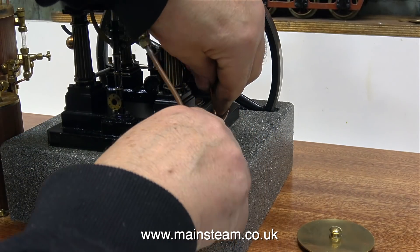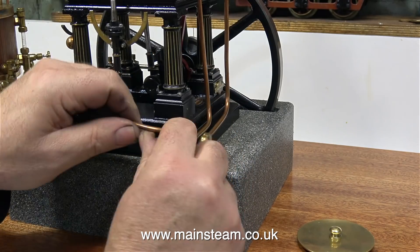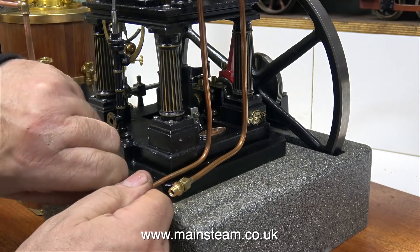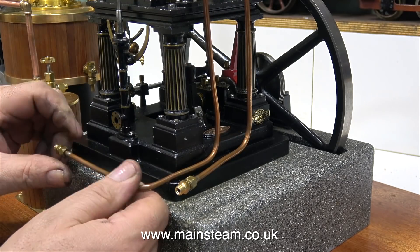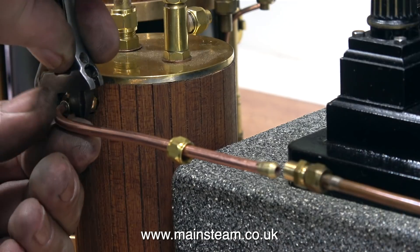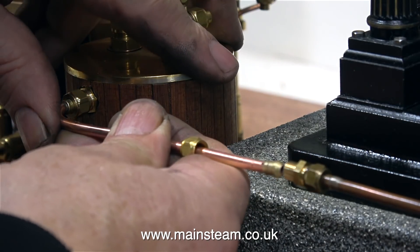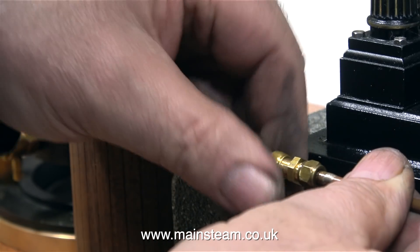I'm going to see whether it's possible to use the existing piping. It's pointing in the wrong direction, so I'm bending it in the opposite direction, which is generally not a good thing to do. Copper work hardens very easily, so after a couple of bends it stops bending — but this copper is bending very well indeed. Having the vice-like grip of a keyboard player comes in quite handy, and in no time at all the pipe is bent to where I need it to be. I've made up an extension piece that goes from the condenser to a quarter by 40 union on the existing pipe, and when all this is tightened up it should be okay.